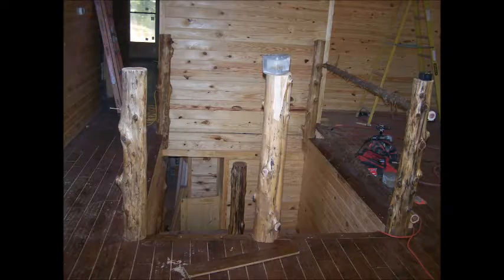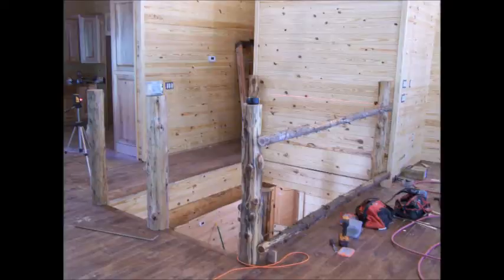The steps are all finished, and the men got the floor down, and we're ready for the guardrails, the handrails, and the newel posts. We'll start with the newel posts at the top. They're all half-lapped over the floors by 10 inches and countersunk and lagged in.